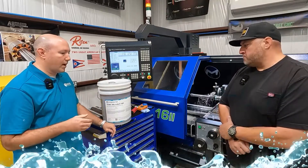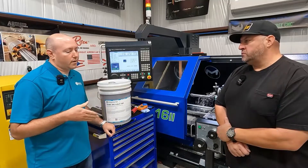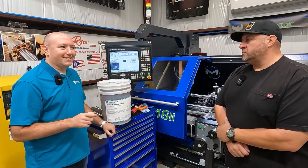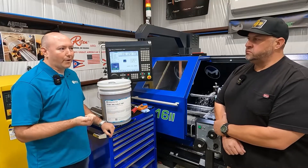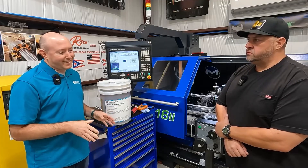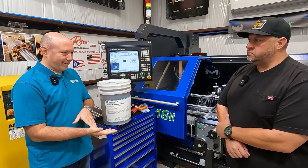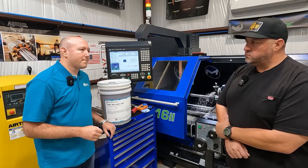685 is also a micro emulsion. Then you get into your soluble oils or emulsions. It's really dependent on the oil content of each coolant. Your full synthetic has no oil, then your low oil and high oil semis, and then your full solubles. Typically there's no industry standard that defines the exact percentage, but typically it's around 50% oil in the concentrate for a soluble.